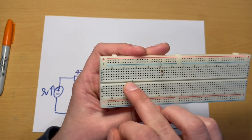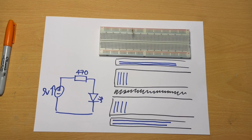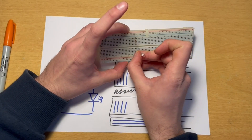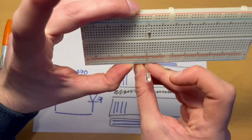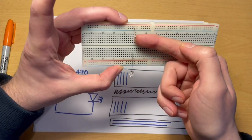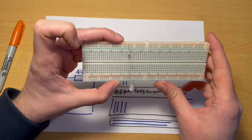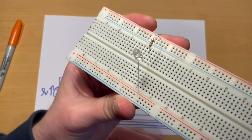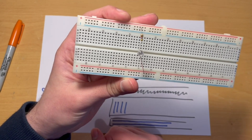One of the common pitfalls when people create breadboard circuits for the first time is they'll place the next component — the LED — in the same row but on the other side of the groove. The problem is that the electrical connection doesn't span that gap, so the resistor is not connected to the LED even though they appear to be in the same row. That connection from resistor to LED is broken. I need to make sure the LED is on the same side of the groove as the resistor, and in the same row.